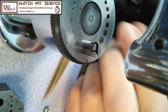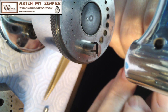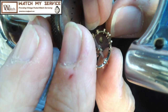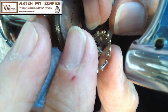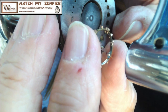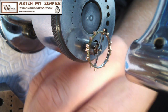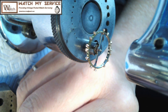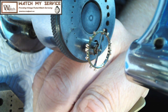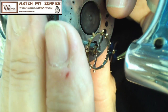Installing the hairspring - I've got to align the hairspring with the red mark on the arm of the balance where it was before, so I minimize my chance of getting a beat error problem. If you've got a beat error issue on the watch it's just harder to get good timing in various positions - even with a strong amplitude it's still going to show different problems in different positions. Poising the balance is also something you can do to prevent beat error issues. This watch was a high-end piece. I recall the pivot on the previous balance staff was bent considerably - I thought I might be able to bend it back but it wasn't possible. You can probably bend it back once but if you try again it'll crack and won't work.